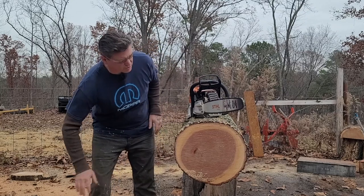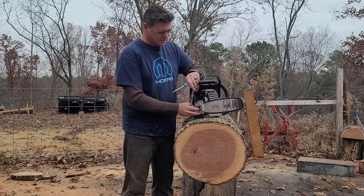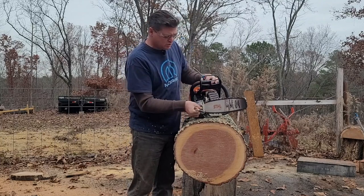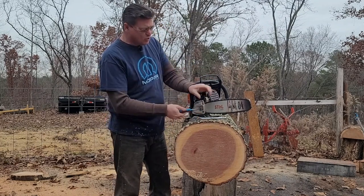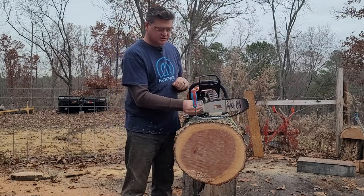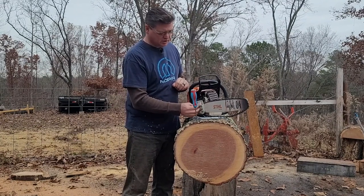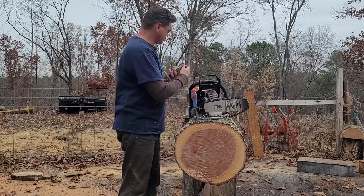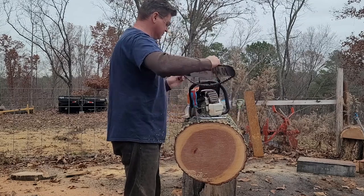So much smoother. Wow. Very nice smooth chain. I admittedly have my rakers too low on that County Line chain, you know, and you can feel it. But it's more than that. These things are sharp from the factory. The C83s, they cut so well. So the rakers are good, and the cutters, they're just getting the job done, you know? They really do.